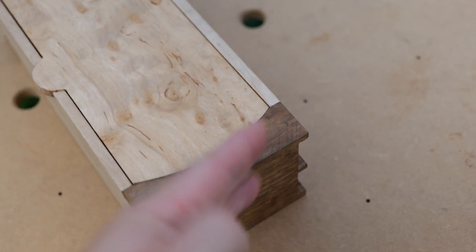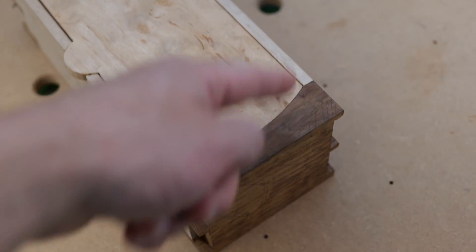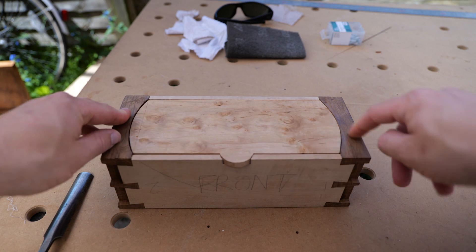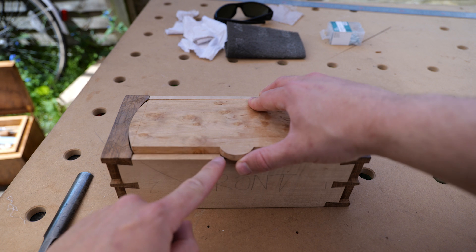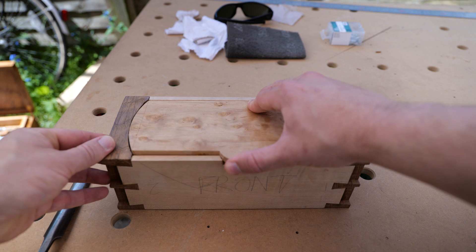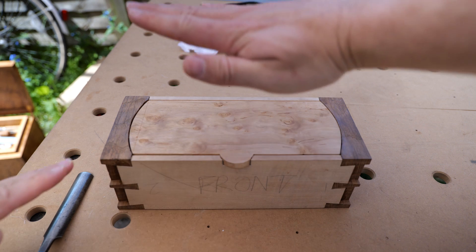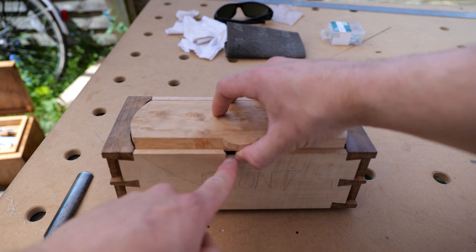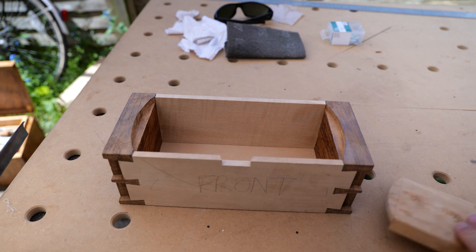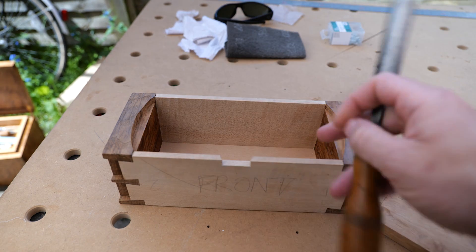Finally, we've got the shaping to do on either end — we're just going to rough cut this with a saw as much as possible, plane it, then sand back to the lines and make it look somewhat consistent. First, I'm going to get started on getting these gaps even. There's a larger gap here and a smaller gap here, and that's being caused by the pull going into the socket — it's actually pushing it across slightly, because the gap is nice and even when I lift the lid up, but when I close it the lid shunts across a little bit. I've got to take a little bit out of the inside wall here, or straighten it up, and then I'll just slowly chip away at this wall with my gouge to get it consistent, alongside a little bit of sanding.